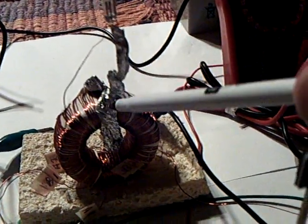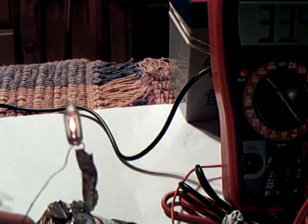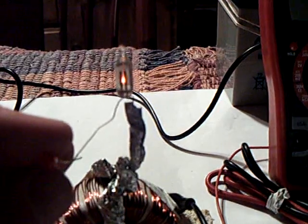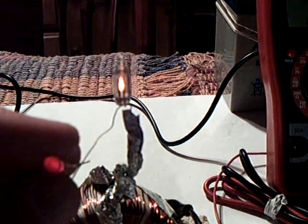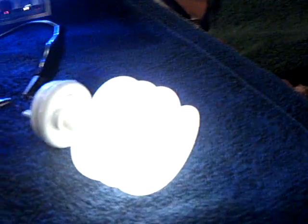Slayer had mentioned in his video and posting that you could take a piece of aluminum foil, wrap it around the toroid, and get induction off of it — and it does work. You can see this neon light up when I touch it here. That's induction coming off of the high voltage coil. You can even take an LED and hold it up to it and get it to come on. That's induction coming off of the secondary, the high voltage which makes the CFL run.